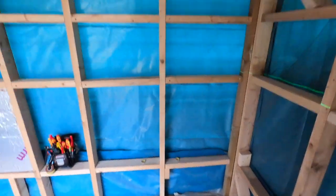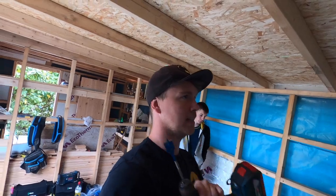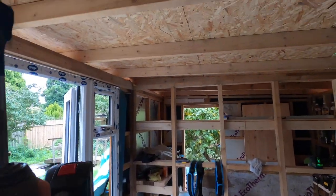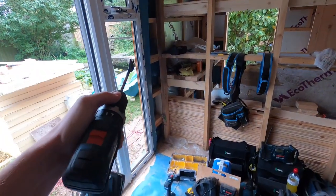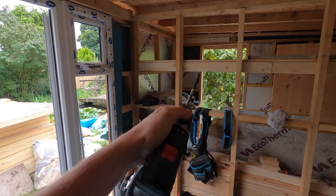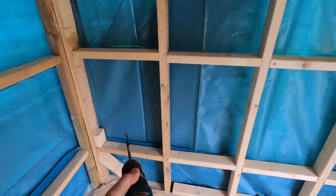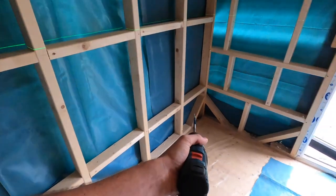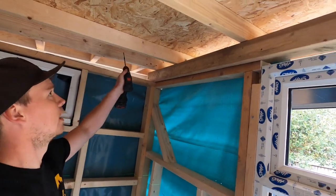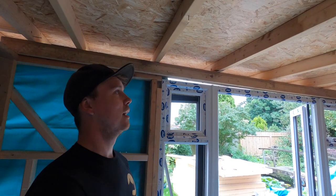We had a discussion before filming about the best way to run the cable, because we're going to take the power to the switch — it makes sense. With power to the switch, if anything ever goes wrong, we don't want to be cutting Celotex and ceiling down. It's only going to be the load side for the lights on the ceiling with no joints. With the switch there, we can put another two-gang switch for an outside light directly above it, and also take a power across to the switch for the shed side. It's then about bringing the flexi-conduit and cables over safely. I want to minimise the holes I'm drilling in the joist — the ceiling is only a sheet of wood on top, so not a lot of weight.